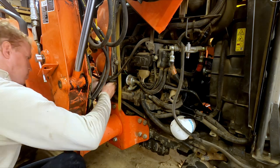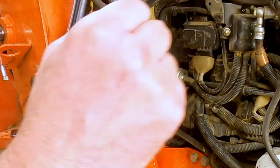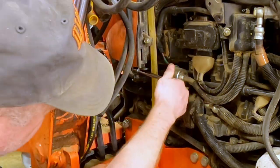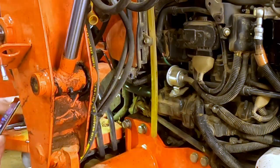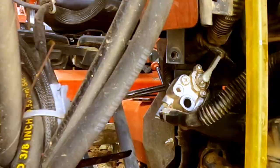If you haven't already, remove the water separator cup as described earlier. Next we will remove the petcock that feeds the fuel system. This is located directly on top of the water separator cup and only has one bolt holding it to the tractor. After unbolting, grab a pair of vice grips and clamp the fuel line, then remove it from the back of the petcock.